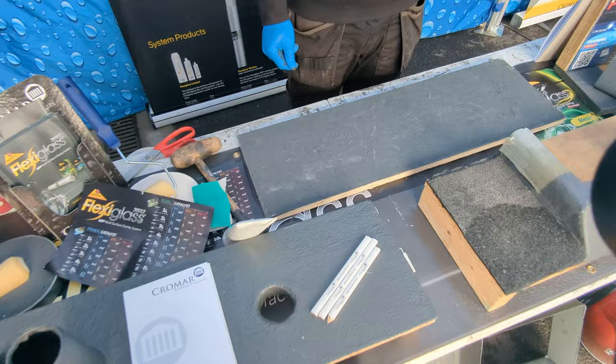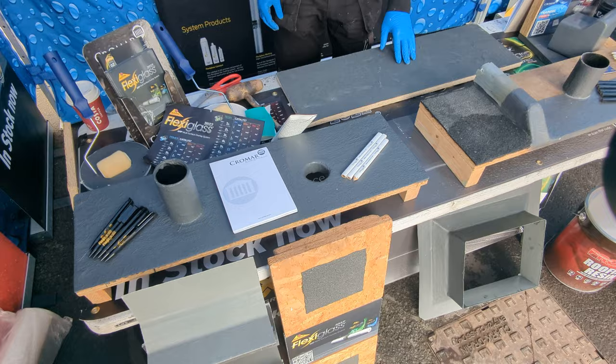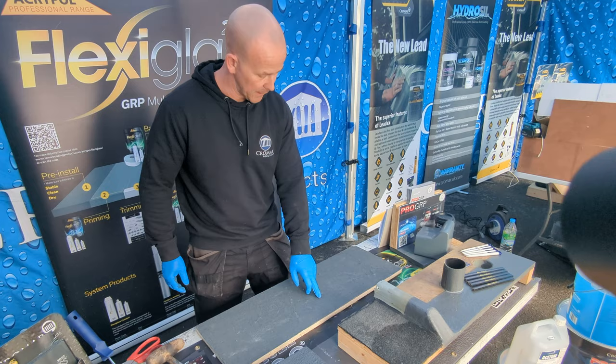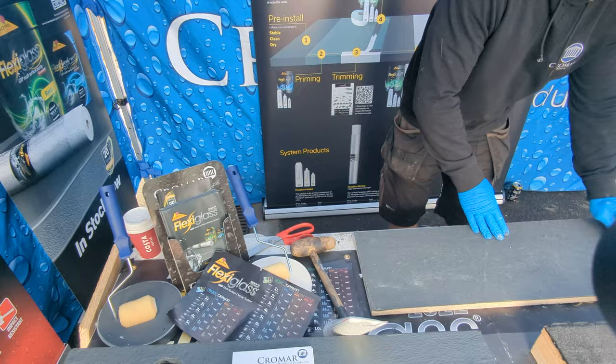You can use it as a fresh top coat. If somebody is fixing up a house and wants the roof to look better, this can go directly on top of what's there. It has to be clean and dry. On this defective roof you can see fibres sticking up and a lot of pinholing — that's what happens when roofers don't put enough resin down. You can always tell by the pinholes and the strands of matting visible. That allows moisture and water in. For defective areas, any fibres left sticking up, simply sand them back.